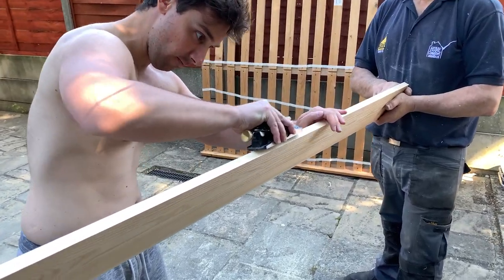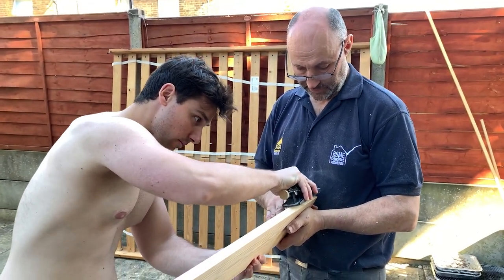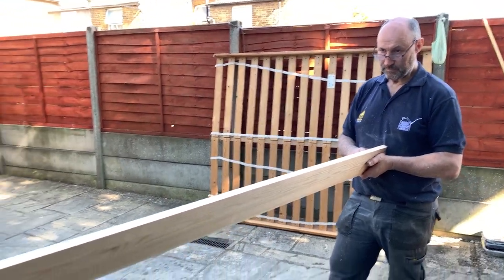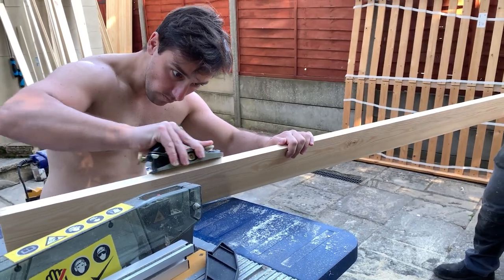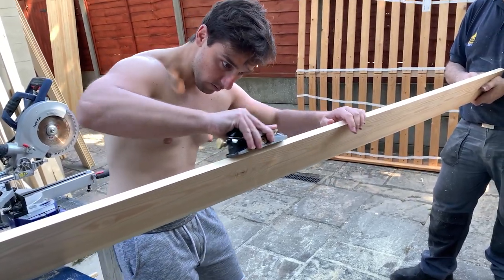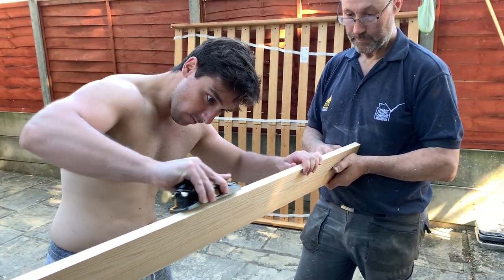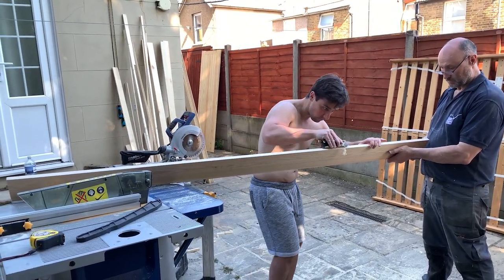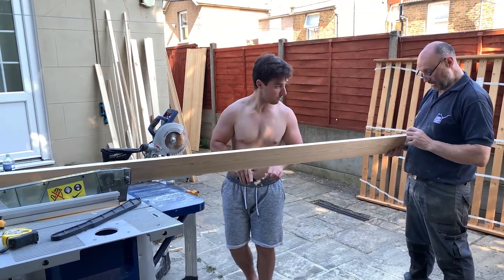Now, when you first cut, there's almost nothing coming off of there. But obviously, as you cut again and again and again, the cut gets wider to the point you can actually feel you're doing something. But you have actually just taken away the corner there. Yeah, now you can see your cut. Yep, it's only the second pass. There's nothing going to break at the end because you're running in line with the grain.